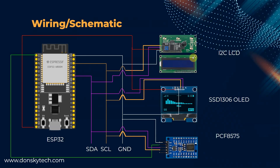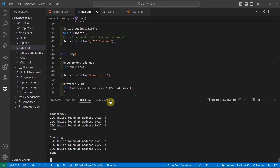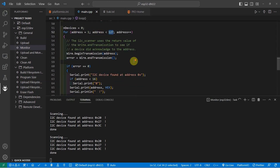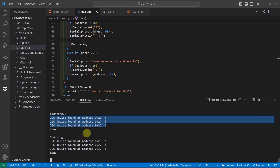Here is the schematic of the sample project I have done in the demo, where I connected the I2C-enabled devices: an LCD display, the SSD1306 OLED, and a PCF8575 GPIO port expander module. There is also a wiring table for a better understanding of the connections. The code is simply a small sketch you upload to your device — it periodically scans all available addresses from 1 to 127 and checks if any I2C devices are connected. In my case, I have 3 devices, and you can see all 3 being printed here, which means my project is now ready to be programmed.